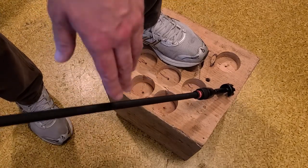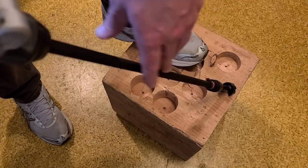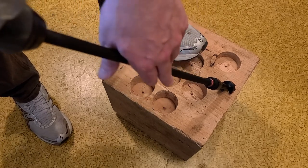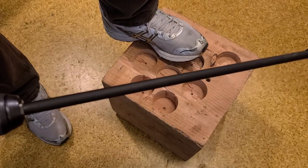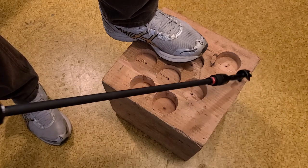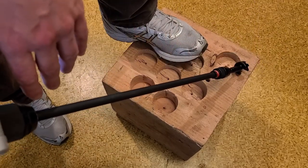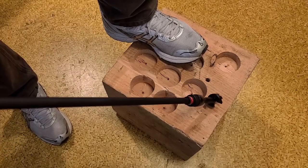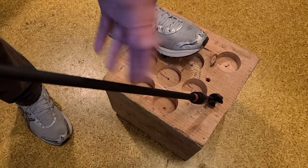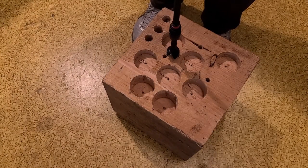With these longer bits you generally run them a little bit slower, because with 18 inches of steel, even though the outer shank is about half inch, there's still going to be some twist and torsion — it'll act like a spring. There's just a little bit of wobble, but making a piece of steel a foot and a half long absolutely perfectly straight is actually pretty difficult and expensive. For 28 bucks, this is really more than good enough for its purpose.